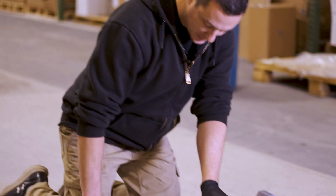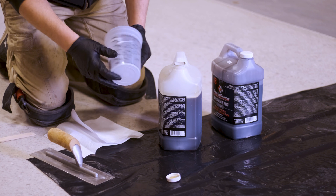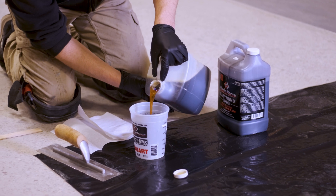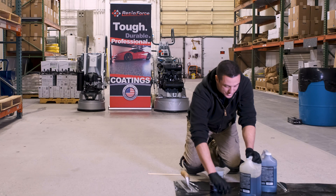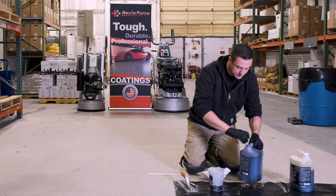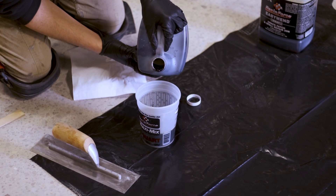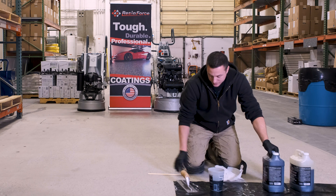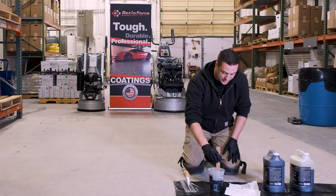I've got my knee pads on and my gloves on. This is a one-to-one polyurea — I'm going to come up to about 16 ounces, so eight ounces of A and eight ounces of B. This specific product I'm only going to mix for about 20 or 30 seconds. I'm not using any sand. When you're doing a grout coat, you only want to use resin, only liquid, because as soon as I add a grit — a sand or any other kind of aggregate or additive — then I'm not going to be able to pull this tight. All the edges of the trowel are nice and clean with no residue from the last floor.